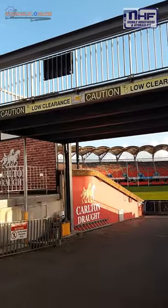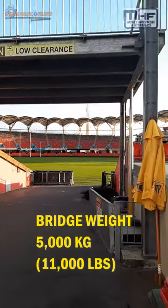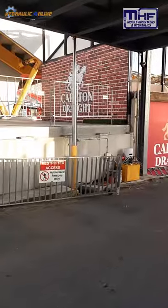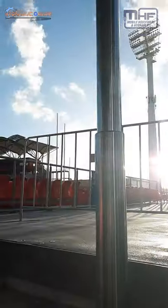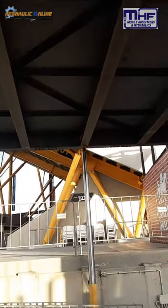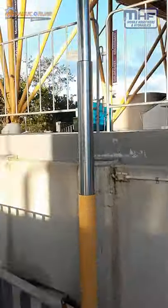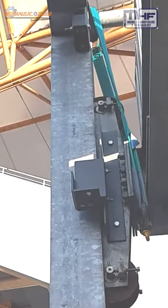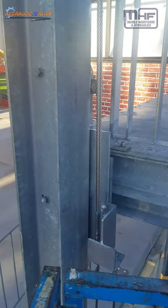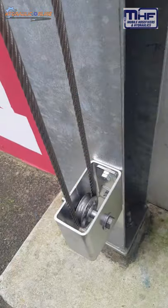This is a recent project — a hydraulic bridge currently undergoing maintenance and modifications. We've had these two telescopic cylinders out, done some work on the power pack, and resealed the cylinders. We're also in the process of installing a cable and pulley system to keep everything more square, because the bridge has been having some jamming issues. Hopefully the cables will prevent it from jamming in the future.